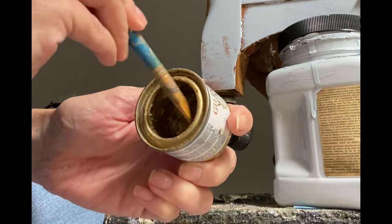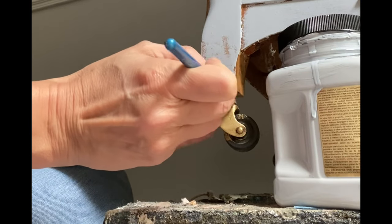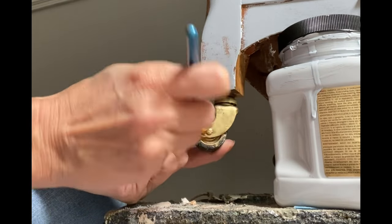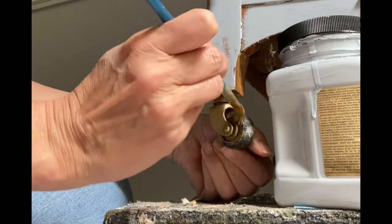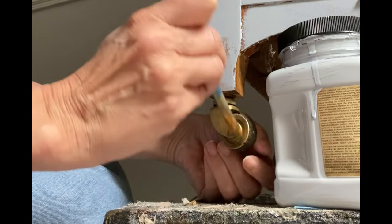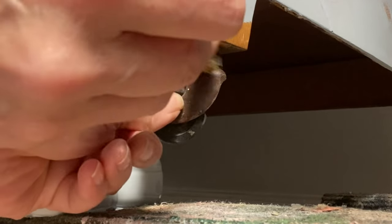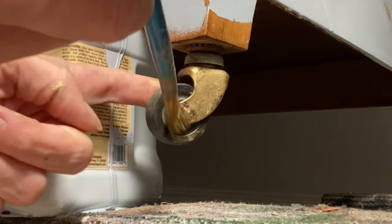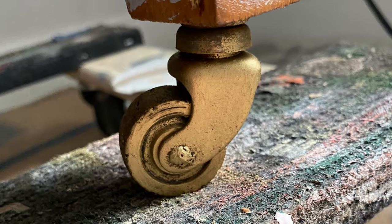Let's get to work on those wheels. Since these wheels are not original to the piece, but I do like them because they give height to the project, I'm going to paint them entirely in gilding wax. Gilding wax is an oil-based product that dries rock solid and hard. I can use it on plastic, metal, and wood, and I'm going to cover all four of these tiny little wheels and get them looking gold and pretty. You can apply it with a brush or your finger and it will dry and cure very quickly. I used Dixie Belle's mud to fill in any of the veneer damages and surface damages around the holes.